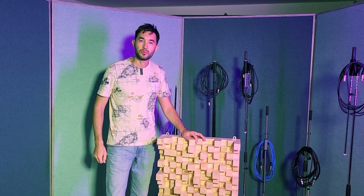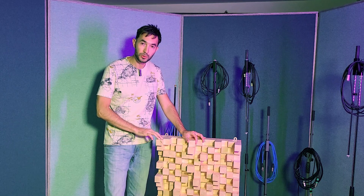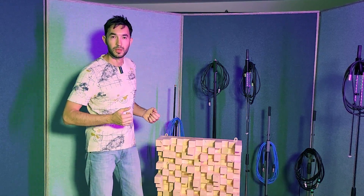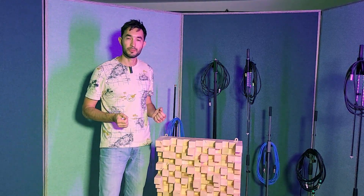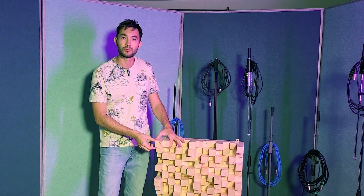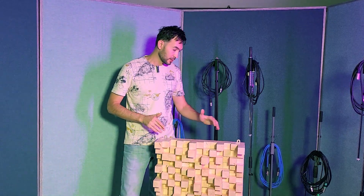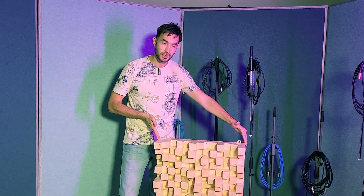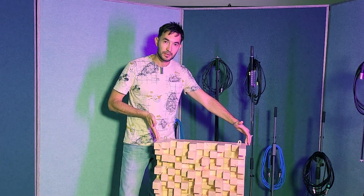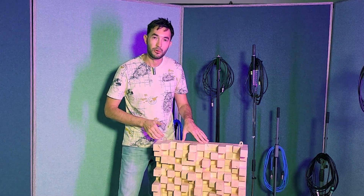You need to have 169 holes because you have to prepare 169 wooden pieces. When I bought the wooden bars, they were four meters long and the other parameters like width and height were 4.5 centimeters. If we look at the backside of the diffuser, every side has 58.5 centimeters, so on each side you can put 13 pieces.